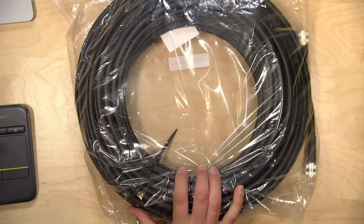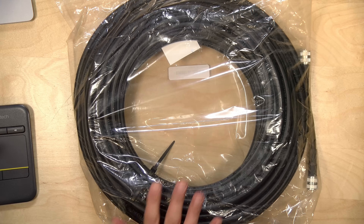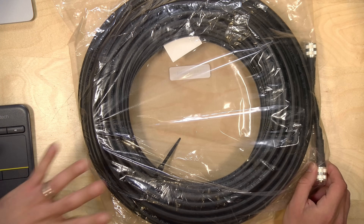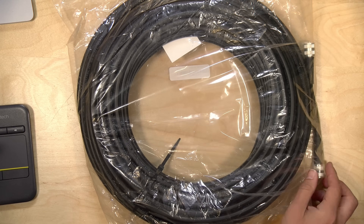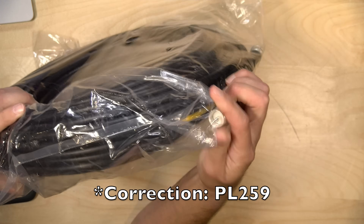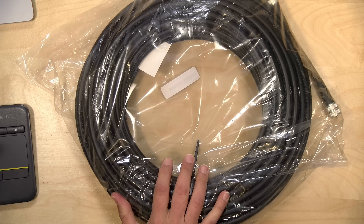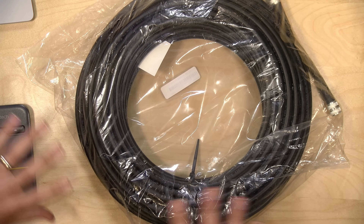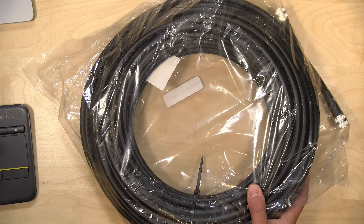Let's start off with the cable that I got to connect my antennas up. I only got one cable here to start because I can only do one band at a time. My intention is to spend a little more time on that 10 meter band initially to explore a part of the spectrum I haven't explored yet. But I did buy a UHF and VHF antenna. This is DX400 cable from DX Engineering — it's 100 feet, more than I would need once my antennas get installed. It has your standard PL-259 connector, which plugs into the radio and also into the antenna. This is outdoor rated, 50 ohm cable — probably more length than you want for a UHF/VHF antenna because you do get signal loss over longer stretches. But I'll eventually be cutting this up and keeping the UHF/VHF antenna run as short as possible.